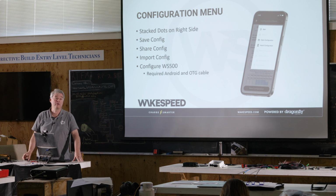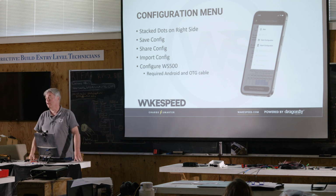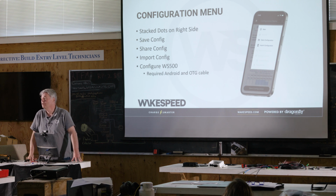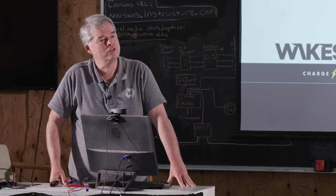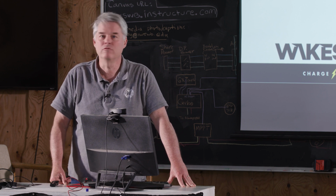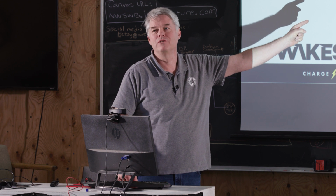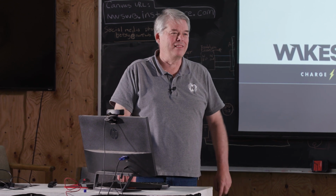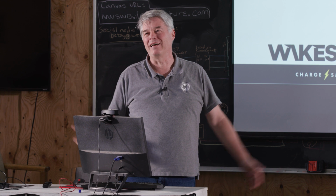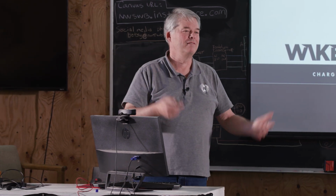I will tell you there's a bug in the current release of the app, and it's being fixed in the next one. The current release of the app is very literal. So if we have a parameter that says 2.500, and we get back 2.50, that confirm will say, those don't match. So we told the app that trailing zeros really don't matter. In the next release, 1.7, that'll get addressed. Okay.